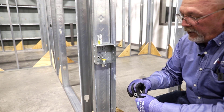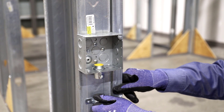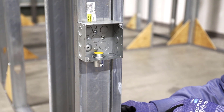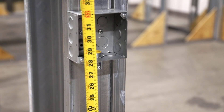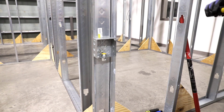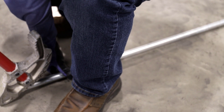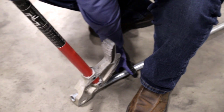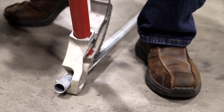With a one-hole strap, it's going to sit up against the stud itself, so I've got to get from here to the back of that stud — that's a box offset. A box offset is a 10-degree offset; I don't worry about take-up or shrinkage only because it's such a small offset. I'm at 28 inches from the floor to the bottom of the box. I'll take a little bit off that to make sure I fit inside the connector — I like to do about an inch — so I know I've got straight pipe going up into the connector.